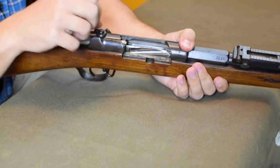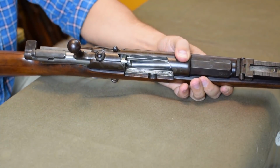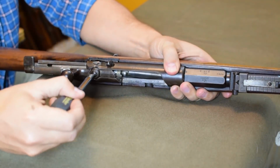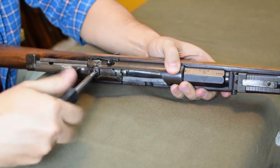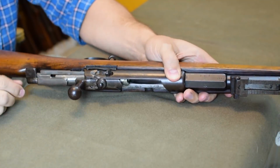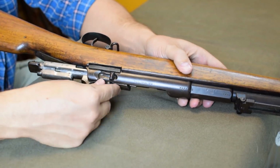Now, since I want to take this bolt out, I'm gonna go ahead and throw this forward. That's actually pretty critical. So just remember, we've thrown our lever forward. We're gonna loosen up our screw and release that round nut. So screws loose. Do not force these. This is captive. It can only go that far out. We talked about that on the 71 update.